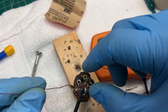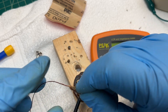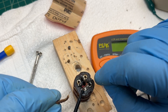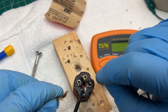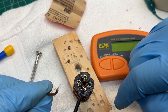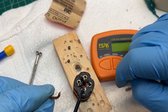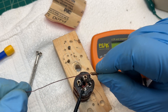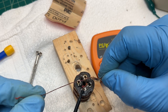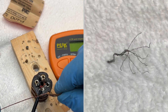Kind of funny — you never know what you're going to find. If you look at the litz wire that went back to the terminal lug, I just cut the wire at this location. Thinking it may be like a 44 to 48 gauge litz wire, it's actually just a single conductor, best I can tell. I'm going to pull some more off the outside wrap and check the DC resistance per foot to determine or estimate the wire gauge. Just the last few inches of wire was litz wire back to the terminal lug.